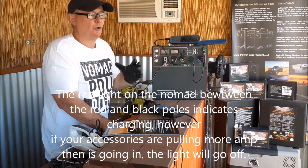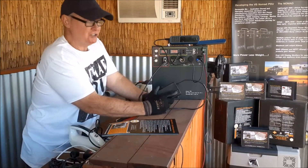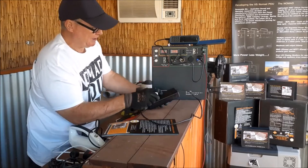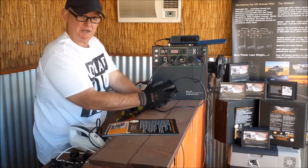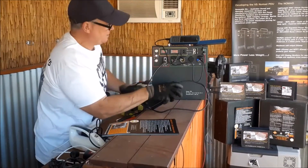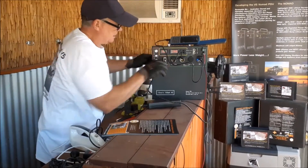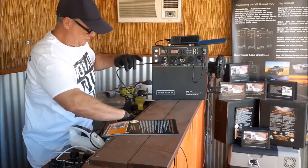If there's no red light showing, all that means is more current is going out than is coming in. This is very important to understand especially when running a solar blanket — we get a lot of calls from people saying the Nomad isn't charging, but it is. On the AC-DC charger itself, the red light means it's charging; green means it's not charging or fully charged. If it's fully charged it'll float and the light may go on and off. You can also watch the voltage display — if you unplug the charger the voltage may drop slightly.